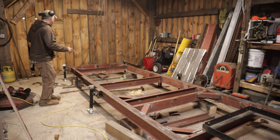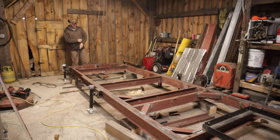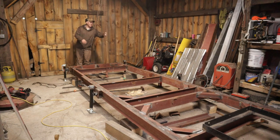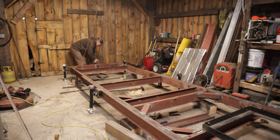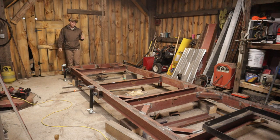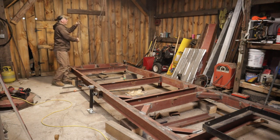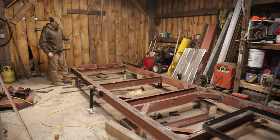What we have to raise this up is I have these one-ton chain hoists suspended from the timbers upstairs. Basically we have a 6x6 spanning three of the 5x8 floor joists, but we put them fairly close to the 10x16 tied knees. We're going to loop our chain falls around these big pipe nipples I have welded on, and try to use it like a big rotisserie. We're also going to scoop this thing back far enough from the door so I can get a tongue on it inside the building.